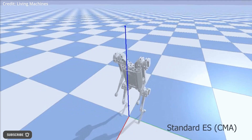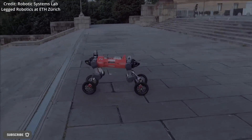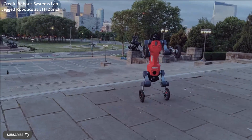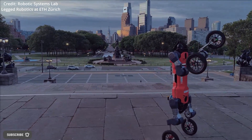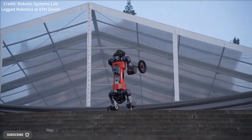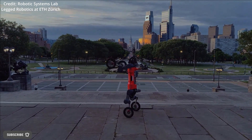To enable a quadruped robot to transform to bipedal movement, a 3D-printed stick is installed onto the shin of each of the robot's hind legs. This additional support allows the robot to stand and walk more robustly. Without the shin attachments, the robot would not be statically stable — particularly useful as the robot stands up, since the attachments support its center of mass during the process.